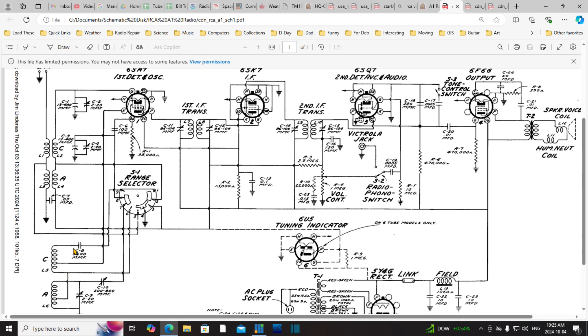So what's happened here? Either the schematic is wrong, the part was installed wrong, or somebody replaced it with a size ten times bigger. This is in the local oscillator circuit — this would be a critical capacitance related to those coils. We've never even tried the short wave side. Meanwhile, if you want to trace the 0.05, you follow the line back and it attaches right to the pin next to the ground pin — that's got to be that capacitor. But the 0.05 was here... I'll cut this one out and see what it is.